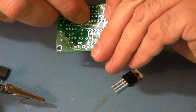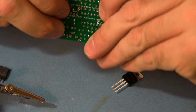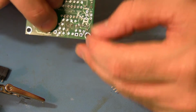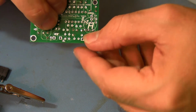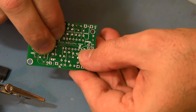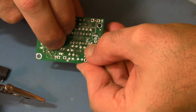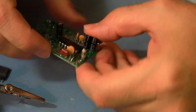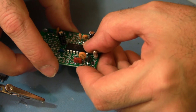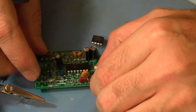And take pin 1 and bend over the pin at about 45 degrees. And then bend over the pin that's diagonal from that, or pin 8, the same way. And you want the pressure on the back side to keep it flush. That'll keep the chip from falling out.